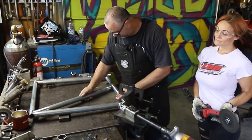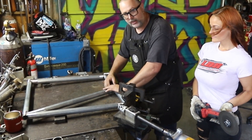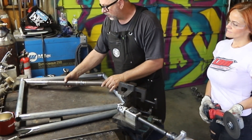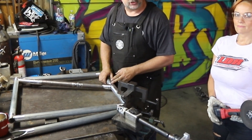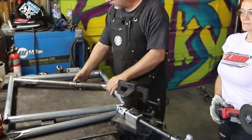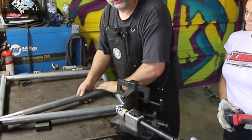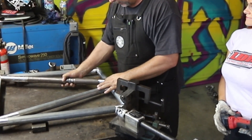The first tube I fit in here, I want this tube to just go over the center point right here. Then my second tube, if everything is symmetrical, should be about the same. I'm going to fit that tube in, and that tube I also have going just over the center point right here. Now the problem is when you go to put this together, if all of your notches are nice and tight — which is what we like, we pride ourselves on tight notches — you can't get this tube into this joint.